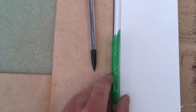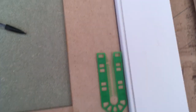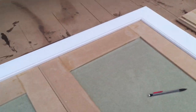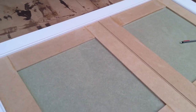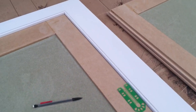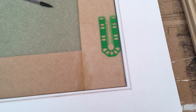With a sharp pencil I'm putting the point against the packer and running it all around the frame to mark the cut line. I'll then use the rail saw with extraction and just cut those bits off. This is an improvement on the way we used to do these years back — before I had this equipment I'd be planing them down with a power plane. But the rail saw is quite a lot quicker and easier when you've got a line to work to.